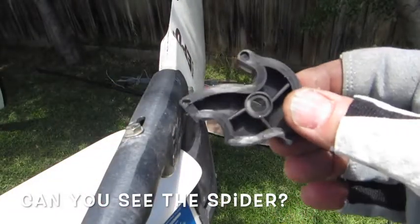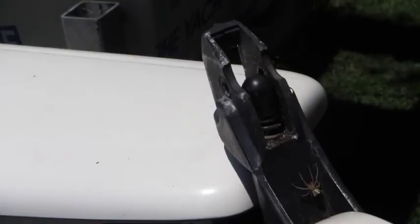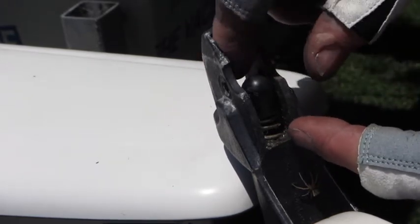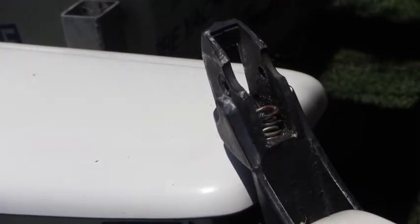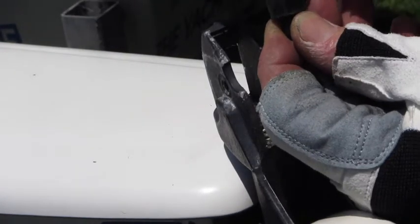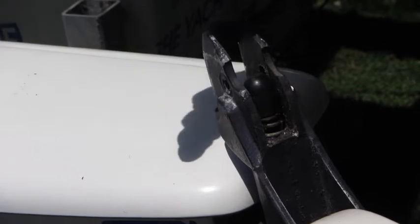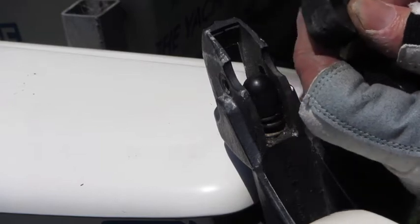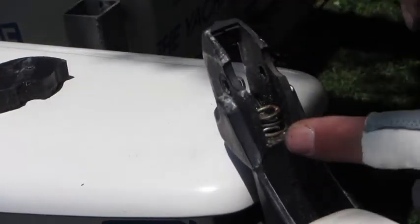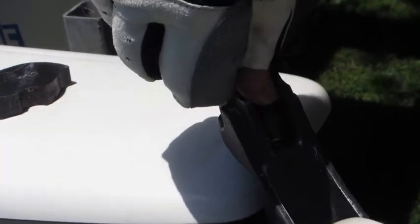So we're going to put a new cam in here from the Hobie Cat replacement cam kit. Part of the reason why these cams are wearing out and the rudders are hard to kick up and down is because this plunger sits on top of the cam, and it rolls around as you lift your rudders up and down. If the spring is too tight it won't allow this cam to turn with ease — it'll be under pressure and this finger gets terribly worn out. The spring is very high and it's very hard to push this plunger right down.